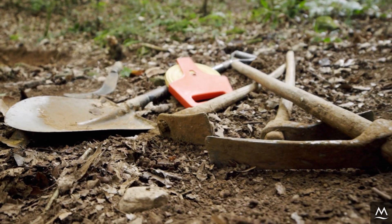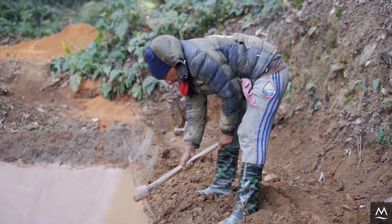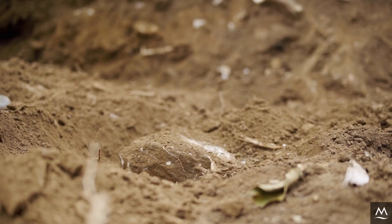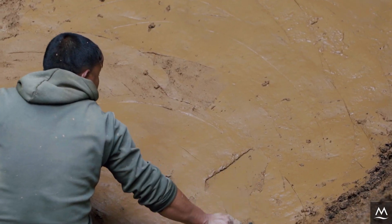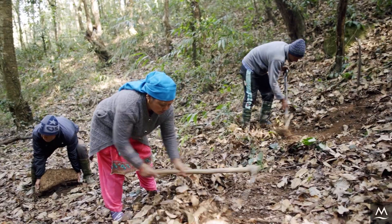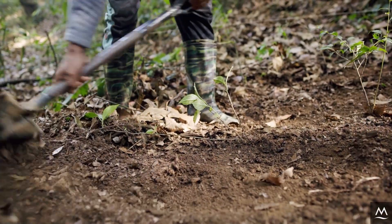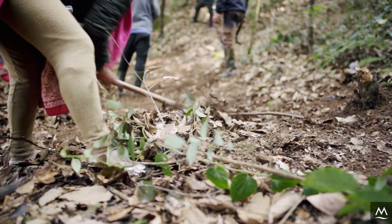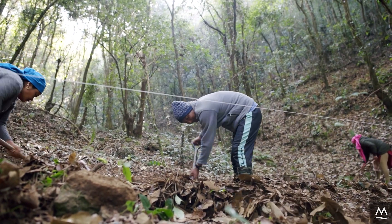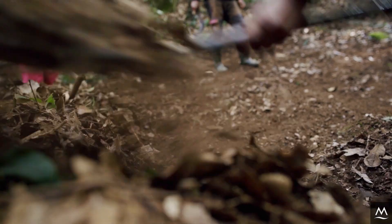In addition to the construction materials, you will need the following tools: measuring tape, digging tools like picks, shovels, and a pickaxe, a wheelbarrow, a sledge hammer for breaking up large stones, and trowels for plastering. Start the construction of the tank by clearing the site of any grass or shrubs. Then start to excavate the soil from the marked boundary with pegs. Make sure to schedule enough time for this — a 5 by 3 by 1.5 meter tank will take roughly 14 labor days to excavate.